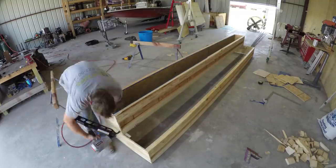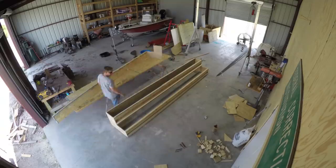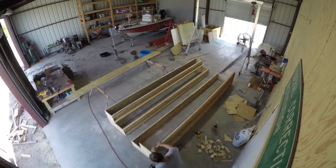When I pour the concrete I'll pour the bottom part first and then put some boards in that bottom portion of the form so the concrete doesn't come out, and then pour the top portion. And this is the form for the second half of the footer.